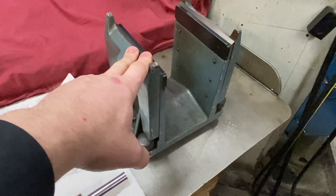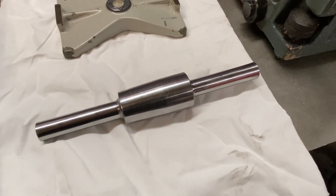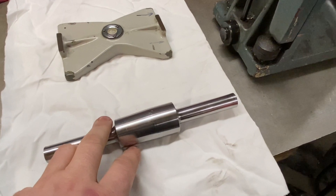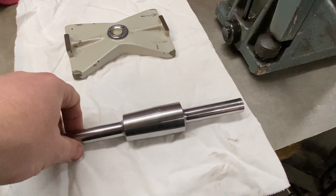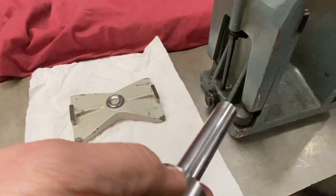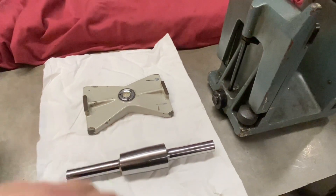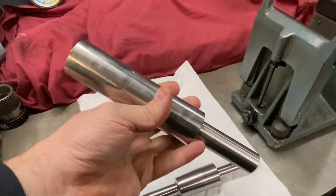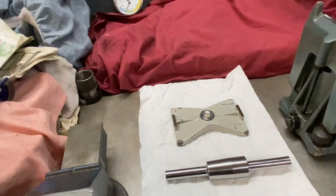This knife edge balancer served me for almost 30 years, and last year I changed to a four wheel balancing unit, which we'll cover in a minute. The other thing you'll need is a mandrel. I made two about 30 years ago, and this is the second one. This particular one has had one major regrind because they do wear and get marked. If you bang it down too hard on the knife edges, there's such a small contact area it will damage it. This one is only made out of stainless steel — it's not hardened. One of the future things I intend to do is to make replacements out of 17-4H1025. I've got a billet of it right here that I've started making. I'm going to make a batch of five and I'll have some available if anybody's interested.